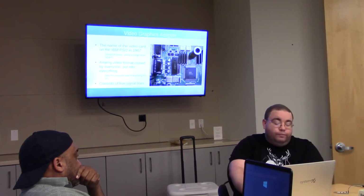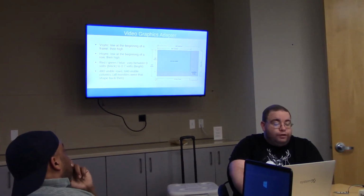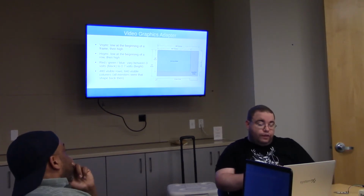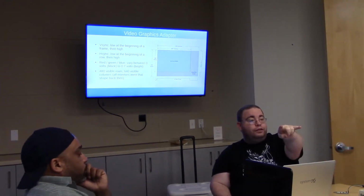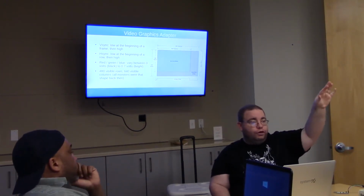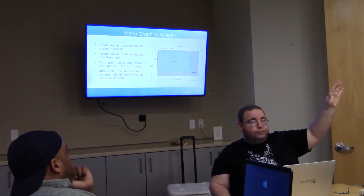But at core, VGA is incredibly simple. You've got 5 signal lines. H-sync and V-sync are high when you are currently drawing visible content on the screen. Kind of. So you get 640 columns, 480 rows. You're going to draw an entire row, then have an H-sync low period, then an entire other row, then an H-sync low period, and so on. You draw 480 rows, then you have a V-sync low period for a bunch more rows, and then you start over again.